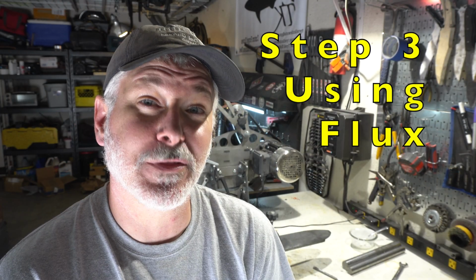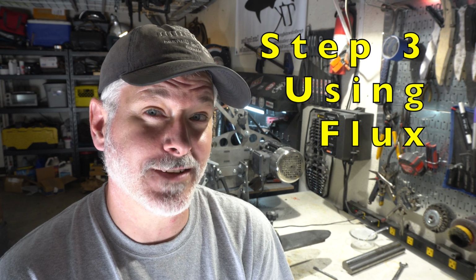Let's talk about step 3. So step 3 is flux, and I gave it its own step because it just warrants a lot of discussion. So some people are anti-flux, and some people think flux is the best thing ever. I think I'm kind of in the middle. Flux is a necessary thing at times, and it's a good thing because it will help you remove scale from your steel. It eats away scale.